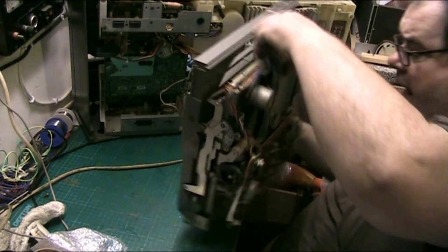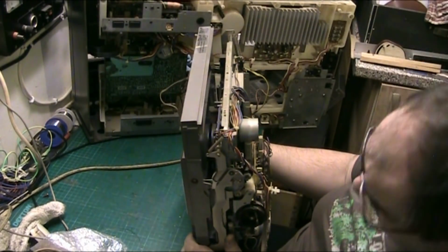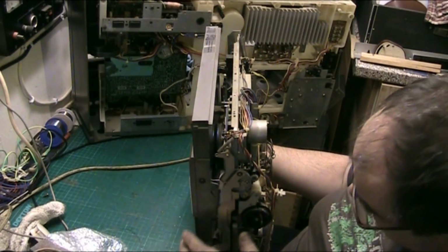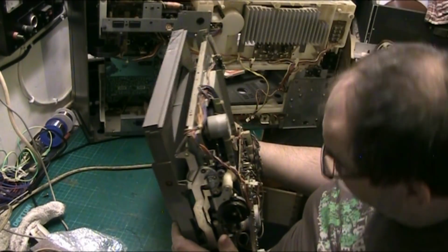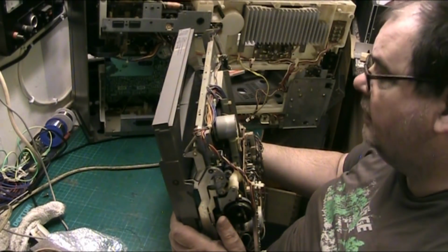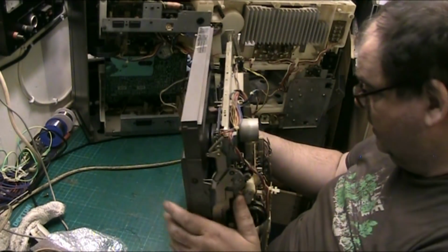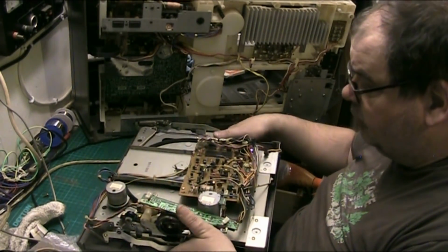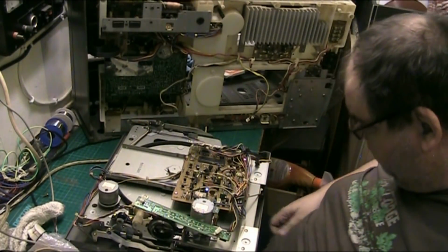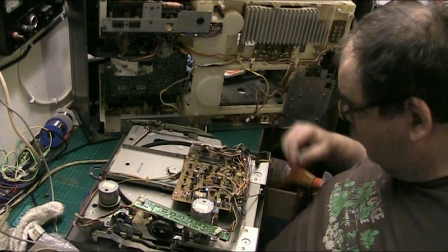Right, and there's the Sharp VZ3000 vertical mechanism. And the main common fault on these was this gear here. It shears. You have to be extra careful with these, because if you're not, you'll shear that gear. And once you shear that gear, you are pretty much in the shit. Now this should be pretty much like servicing any other sort of turntable.